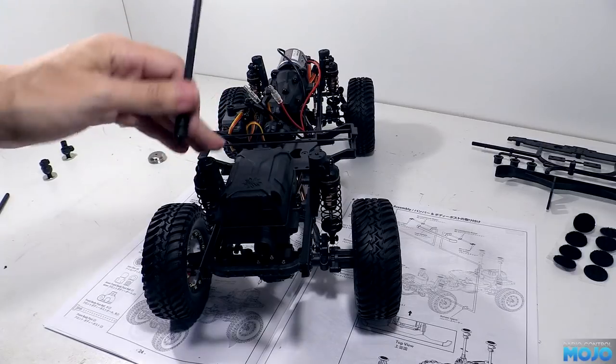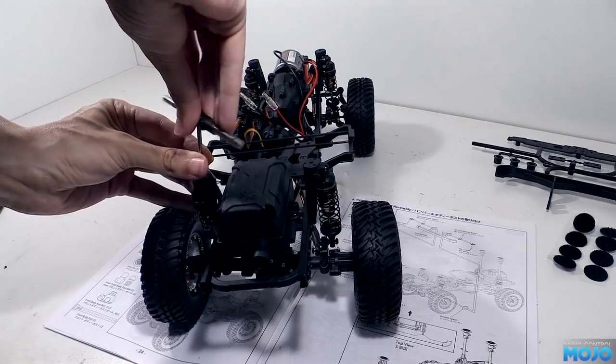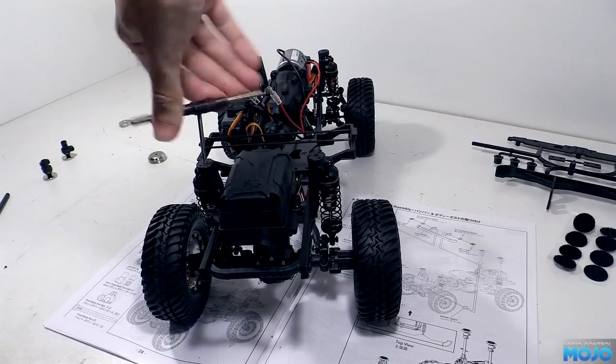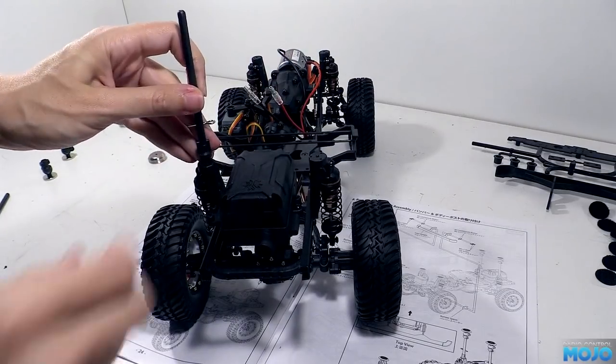It's just possible we could use an M3 screw to form some threads to make it a bit easier, but better still is to use a proper tap. We just have to watch out for overshooting and damaging the tops of the dampers. You can just about see the bottom of the hole, so it's not a major problem. With the holes threaded, we can screw on the posts.